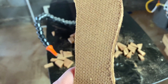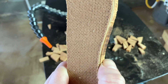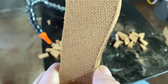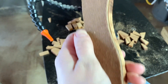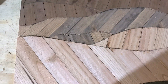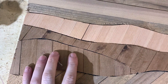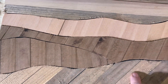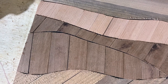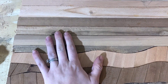Now that I'm done, I evaluate to see where I missed the mark. You can see it's kind of bigger right here than the template, so I can either sand that down or I'm going to correct it now with the scroll saw — go back and carefully try to get all of this to match up as closely as possible. The more time I spend doing this, the better the fit is going to be. I have all the layers cut and some of them look good, but I'm still disappointed with the fit of some of them. If you have any ideas or advice on how I could get a better fit, please comment below — I am still learning myself. I'm thinking maybe using a flush router to get it perfect might work better, but it's still going to look good and has a good rustic feel.